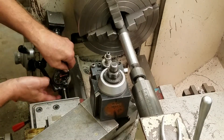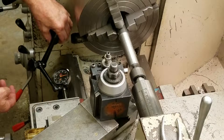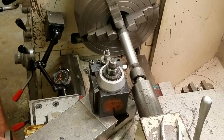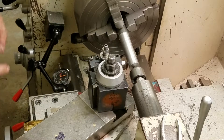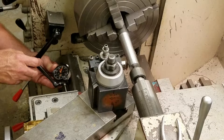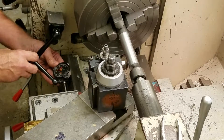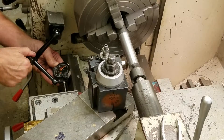Let me back this up just a hair so I don't run out of indicator movement. Keep the indicator in a straight line — horizontally and this way — because in trig it could pull us off quite a bit. Let's adjust this indicator to zero. Now I move my tool back and I'm going to go ten rounds on the indicator. When I stop, that's exactly one inch. But we want three inches, so I'm going to come back and do this again. I'll barely bump it and go another ten rounds — that's two inches.